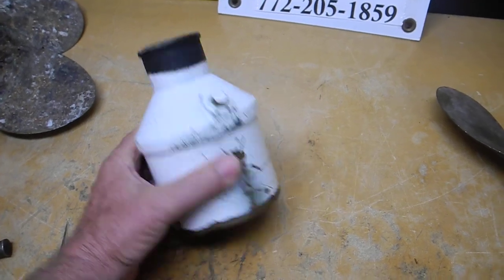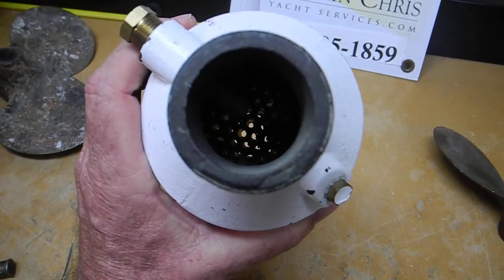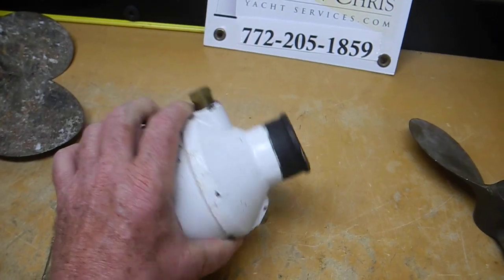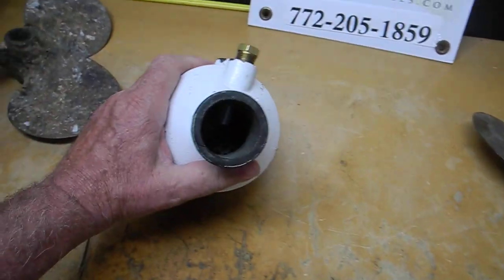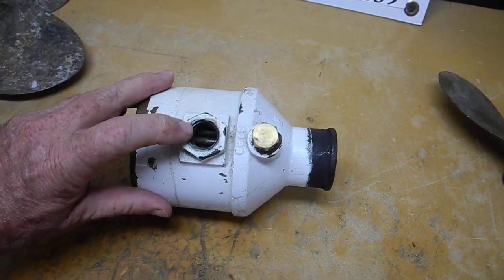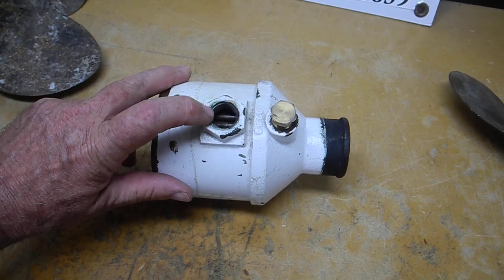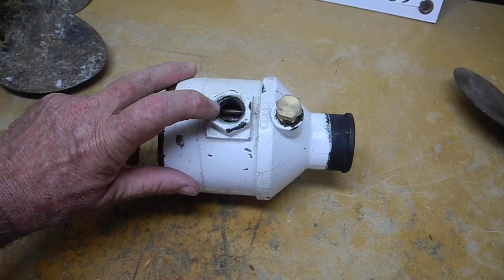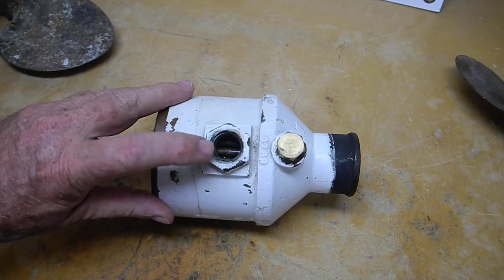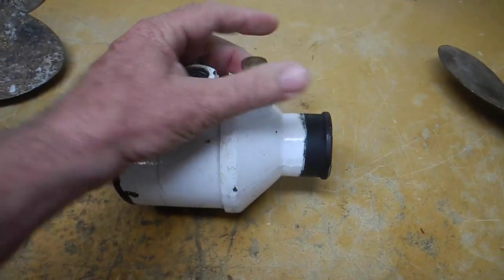But let's go inside the boat. What's inside the boat? You've got tubes in a shell heating element like this — it's actually called a heat exchanger, used to cool things. Inside, you've got a hose that connects with raw water running through it, and then hot oil going in there — it might be motor oil for the engine or transmission fluid for the transmission. To protect all of the welds of all these little tubes inside, we have a zinc.